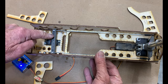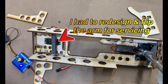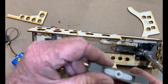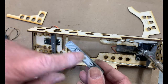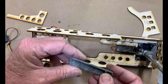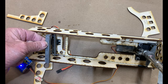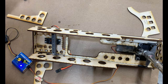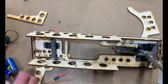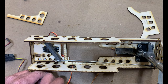I've got a custom made servo arm here — I'll show you how that's done. It's actually 3D printed, solid, no fill, and this is what it looks like. It's a regular servo arm underneath — it gets glued and screwed in, then it simply goes on a screw, goes in here, and as you can see it just swings like that. So now we've got the gear down — that's how it works.